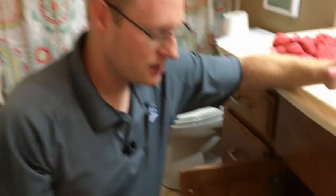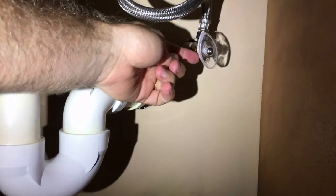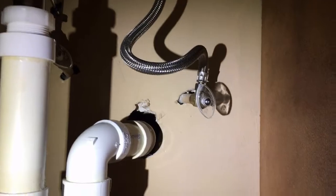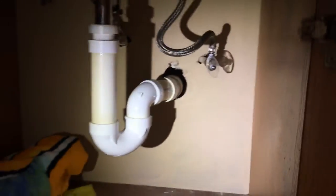The last thing is to monitor your faucet over the first few uses to make sure it's not leaking anywhere around the base and everything's working okay. You also need to check the valve you turned off underneath the sink a few times — while that valve made this project a lot easier, it can leak when it hasn't been used for long periods of time. The most common place it'll leak is on the valve stem. If it is dripping, you'll have a new project, but you can place a little Tupperware bowl underneath it in the meantime. Other than that, I'm glad to wash my hands of this one — we're done.